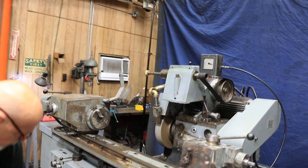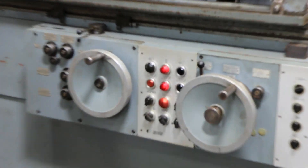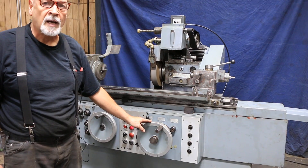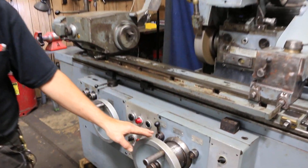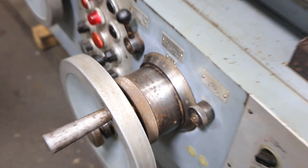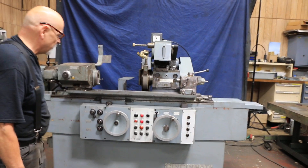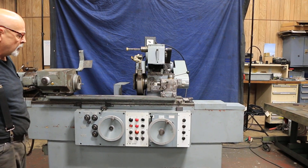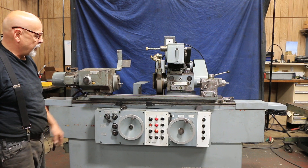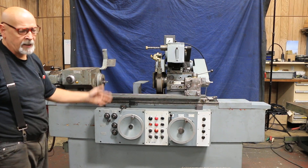You also have with this machine the ability to use a longitudinal table. We come in now and have our feed in the plunge grinding mode — this is up against your dead stop. In plunge grinding mode you use this to get your part on size, then leave it at zero against the dead stop. In longitudinal or traverse grinding, we're not using the mechanism on top; we're working with this pick-and-pull type arrangement — it's very fine. You can adjust that step to be bigger or smaller. It'll just keep going until it gets to zero. There is no spark out when doing longitudinal grinding; it just comes down to zero and stops.